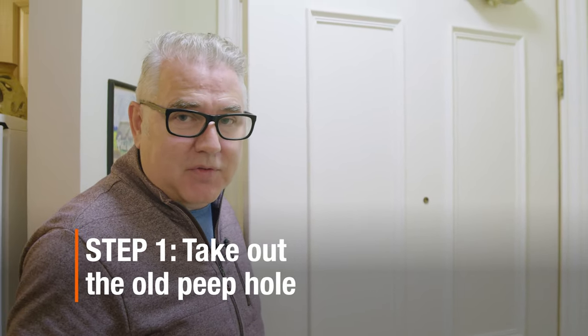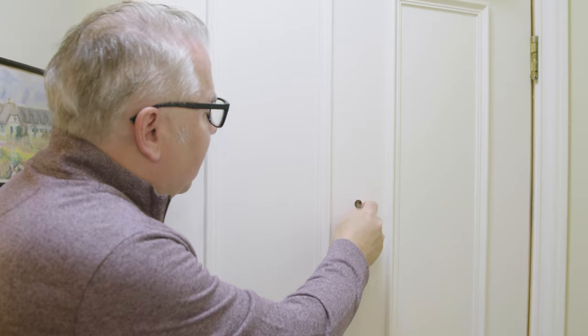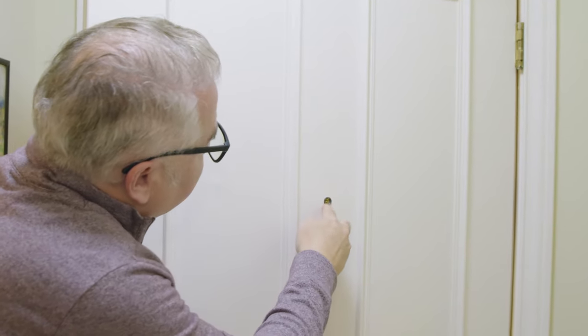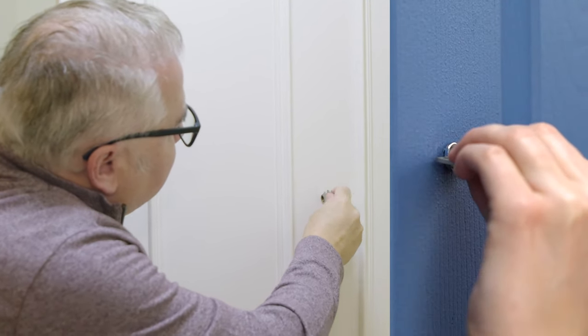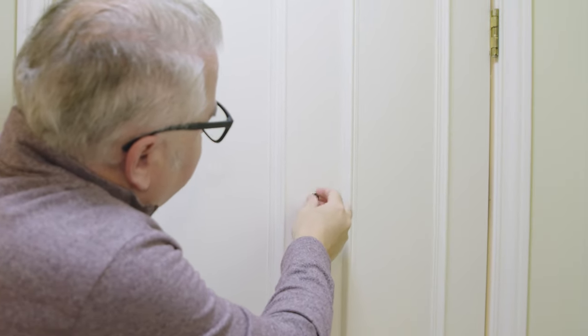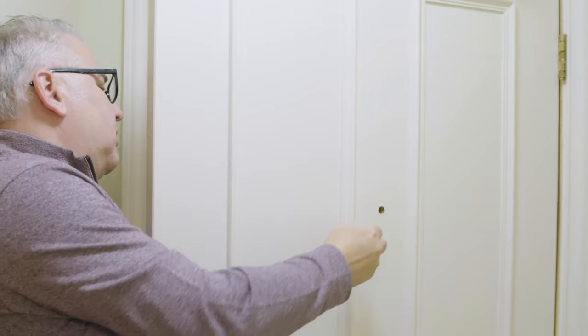The first thing we've got to do is take out the old peephole. I was a little worried about this — I thought it was going to be pretty difficult, but it's not. The only thing that might be a little tricky is if you've recently painted the door and the paint is making the peephole stick, but it does come with a little tool to make that easier. There are two notches in the peephole itself — you stabilize the front part and put the tool into the notch. It's almost like a screwdriver; you unscrew it, and once it's past the initial part you can do it by hand. And it's completely out — now we've got a hole where we're going to stick the new Ring video doorbell in.